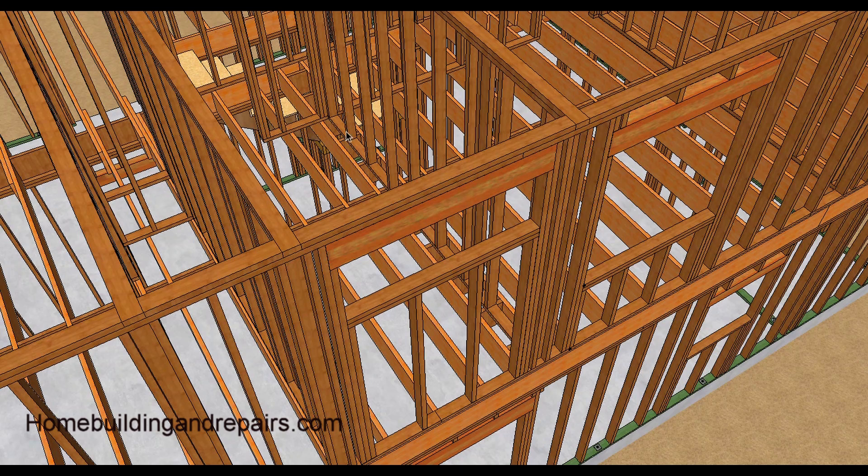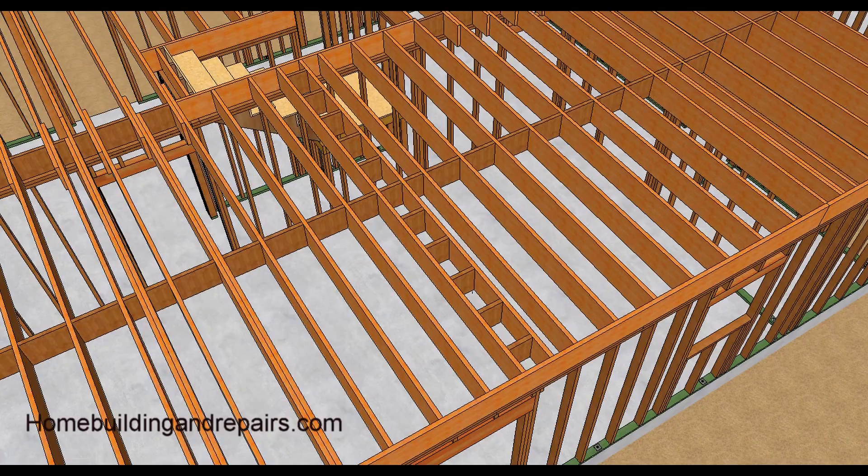Here's the wall with the plumbing in it to give you an idea. If you had a wall with a doubler underneath and needed to get plumbing pipes — for vents or drains — the plumber would have to go on one side of the doubler and then angle at 45 degrees to get the pipes in. This won't be a problem if you have a cabinet to cover the pipes, but it will be a problem otherwise. During the design phase it's worth figuring out if a different framing option is better than the double joist.